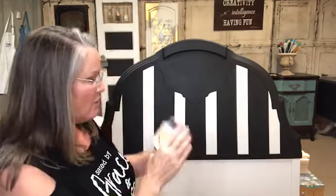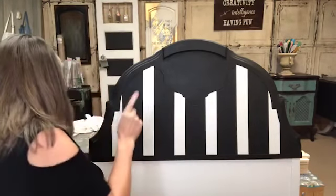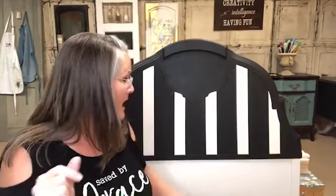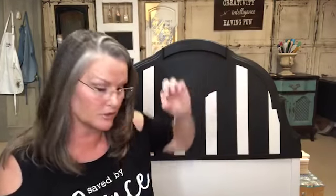I know. So I painted the whole kit of Fluff, okay? So there's where the stripes come in. This was all white. What you can't see is that this has some little indentions around it on this little twin headboard, and I went ahead and painted the outline of it black, and the rest of this was white across here. Super, super easy to paint stripes. But after you paint it, I like to seal the paint before you put your tape on, because we're going to be using some blue painter's tape to map off where we're going to put the stripes.